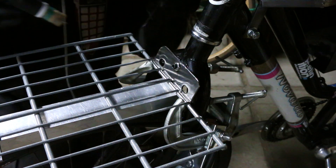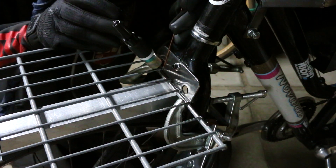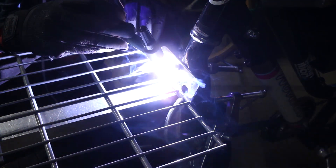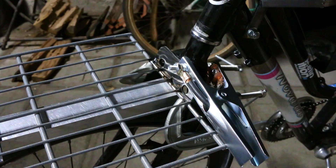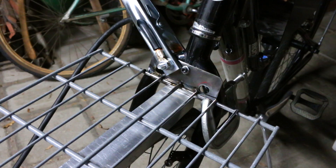The idea I came up with was just creating a platform for the bin to sit on top of. One of the reasons I went with this design over something where the basket was hanging from the top was that this is going to be a lot more robust. Sure, it is a bit heavier, but I can put much heavier items in the front bin because I don't have to worry about the bottom of the bin being the weak point. Another cool thing is that if I make the bin removable, I have a flat surface that I could mount and strap wider things to.